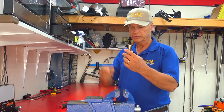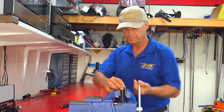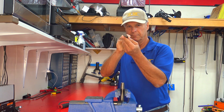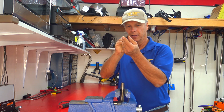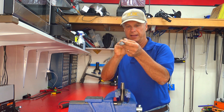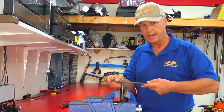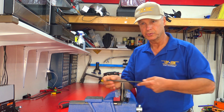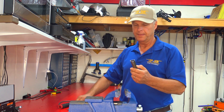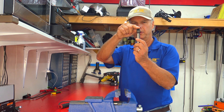Now to make this, you simply put it in a vise. Get yourself a half-round file — you can get these anywhere. I like Nicholson files myself, but you can get these at Home Depot or anywhere. You want a half-round file, not flat. And you're simply going to file until you get a nice round surface on it. Like that — matches it very well, and we're ready to weld.